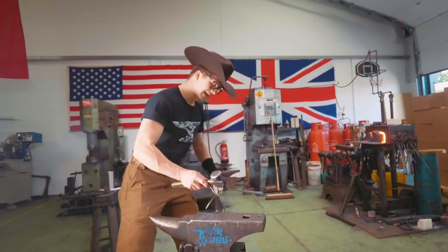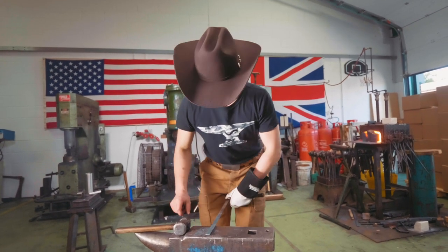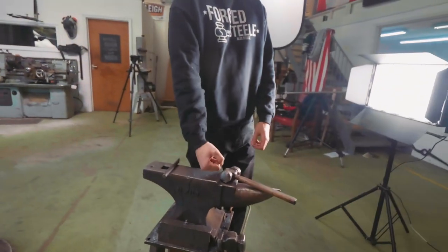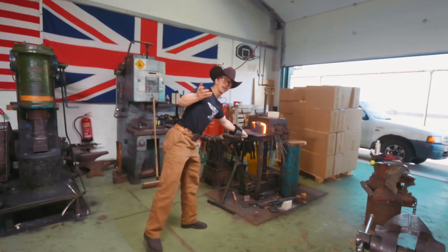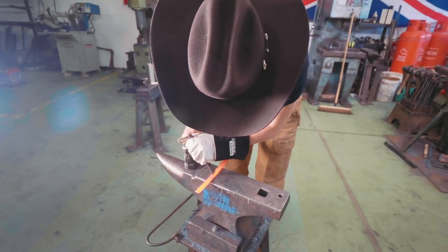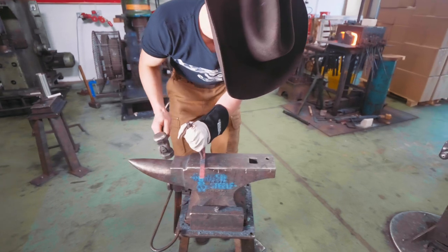What you want is when you're working, you can get the full swing of the hammer without having to completely lock out your elbow, but you can still use your legs — your third hand, the blacksmith's third hand — to hold on to things and work with these two hands free. Jamie's a few inches taller than me and his knuckles drag at the same height as mine. Anvil heights are pretty consistent even when there are disparities in height, and it tends to be between 30 and 32 inches where most people need to be with their anvil, unless they have really long or really short arms.